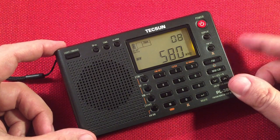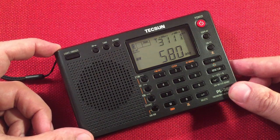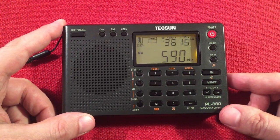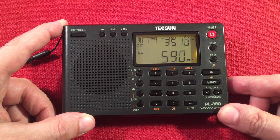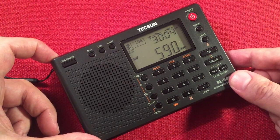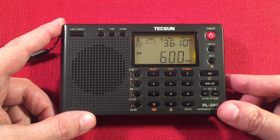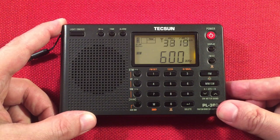The slow tuning's not bad, going 1 kilohertz. That's a fine tune. Okay, they're getting multiple stations here. I was just waiting to see if I got some call letters. Usually this is WTCM, Traverse City, Michigan, 215 miles away, 1,000 watts. That would be one I would hover on and wait. WKZO. This is KXSP, Omaha, Nebraska, 405 miles, 5,000 watts. They air the games. It's going good. Here's WMT, Cedar Rapids, Iowa, 175 miles, 5,000 watts in the evening.